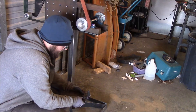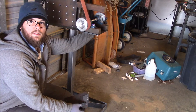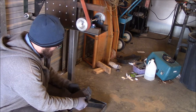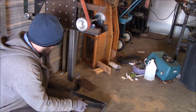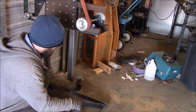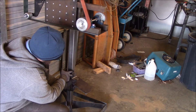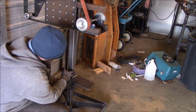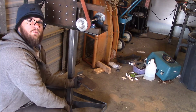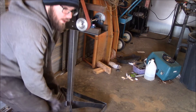What really matters now is that given where this pulley is — kind of up here — I have to have the belt hang down here, and I have to have the motor mounted in a fashion that those are lined up planar to each other. So it's probably not going to be a straight-up mount like this. I'm probably going to have a little arm that moves this mounting plate further back, because that's what it's going to take.